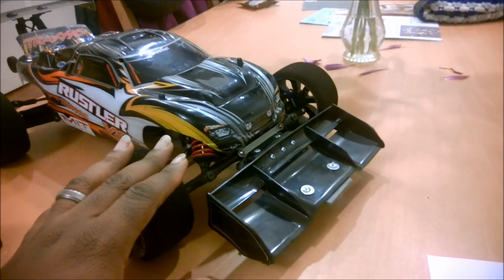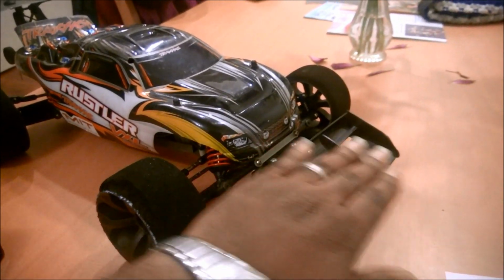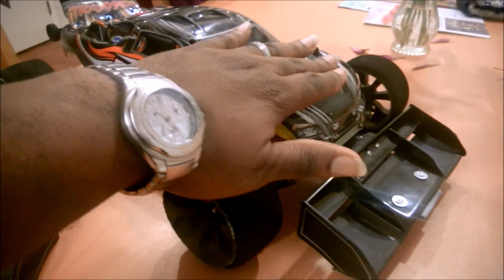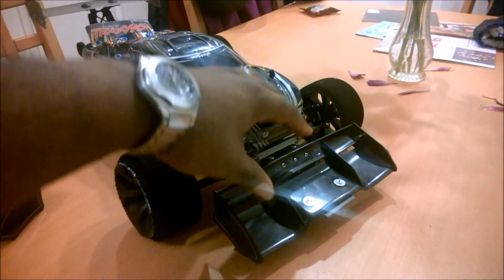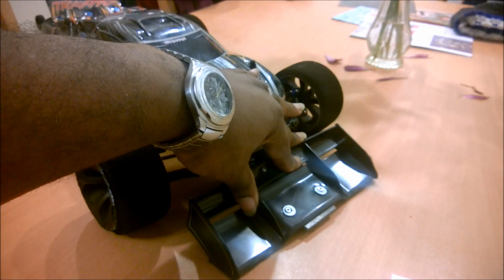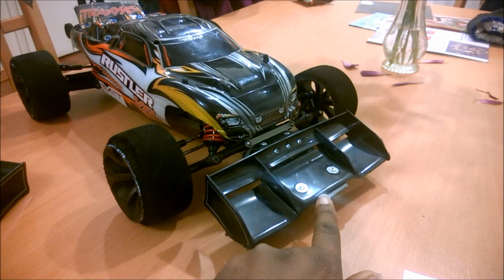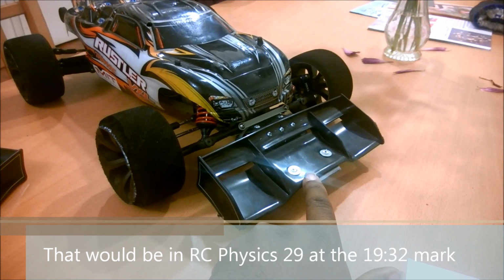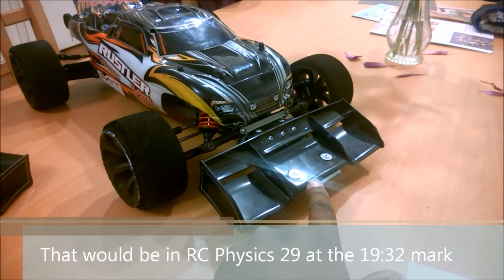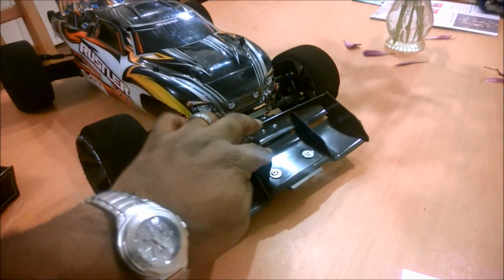But I figured that was a trade-off, because I'm getting some drag there from the interference where the air from this interfaces with the free stream, but I'm also canceling off a lot of lift. And as you guys have seen, when this thing catches air, it digs in. And when I did that one particular run where the support bracket broke off, that was because it was secured with zip ties, because I was still testing out the theory. Now I know the theory works, so I've riveted it in place. But basically, now this guy's nice and strong.